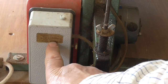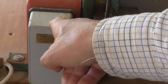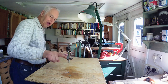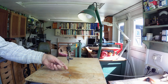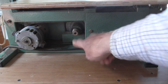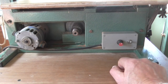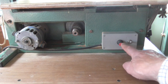This little device here is electrically powered. When you power up the saw, it turns on — it's very quiet running, and it blows through along this little tube through the frame, and there's a little nozzle on the front. When you turn the saw on, you get a jet of air which keeps the cutting line free of dust. There's also a thread in the end of the shaft, and they did supply a flexible drive which you could screw in and use with a little drill or sanding attachment, which was quite useful.